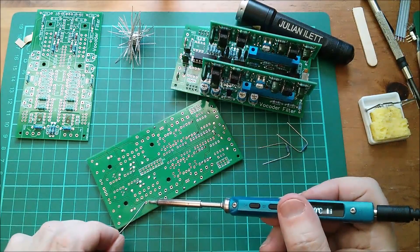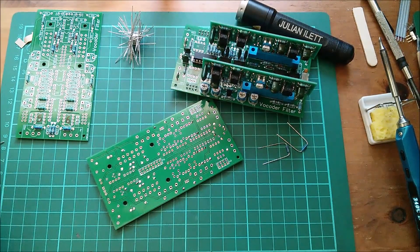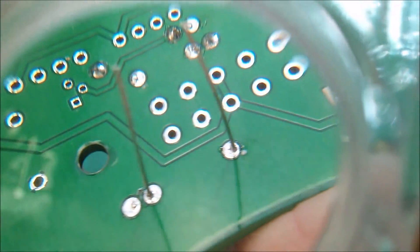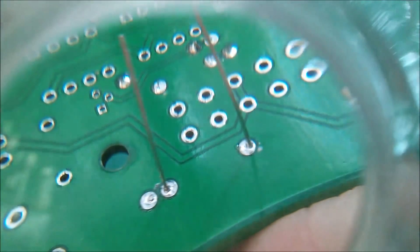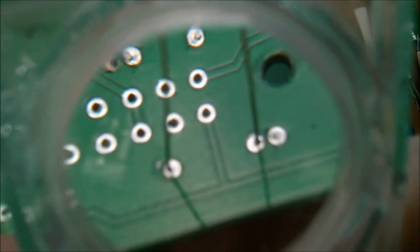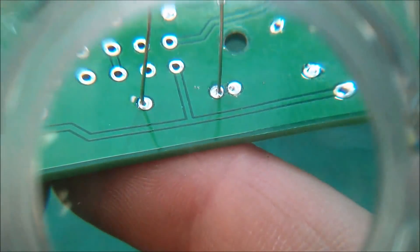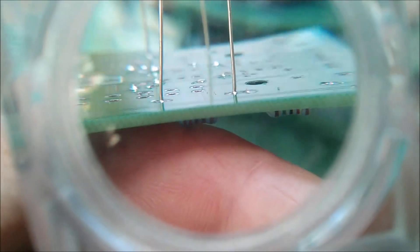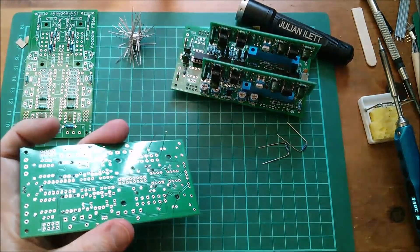I'm putting it in so it's a concave thing. Let's have a quick look - yeah they're relatively flat and concave. I'm not mounding them up. Let's look at the ones on the other side - yeah I'm quite liking this approach. Very flat they are - no great mound of solder. I figure you don't need it because look how thick the board is, and that solder runs all the way through the hole - it's more than enough. That means I can also cut the leads much more flush to the board.